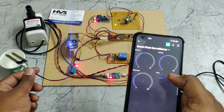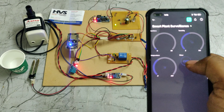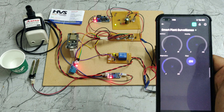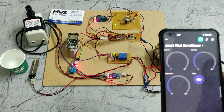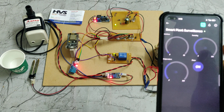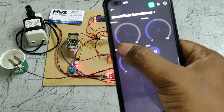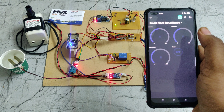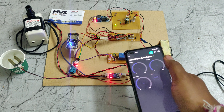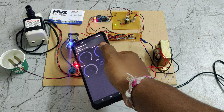There is a low moisture level reading from the sensor. After observing that, we can control the motor. You can see the status on the relay — the motor is now running. Once the water level increases, the moisture level also increases, and then we can turn the motor off. You can see the relay turns off. When the relay is off, the LED will be on, and when the relay is on, the LED will be off.